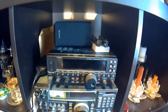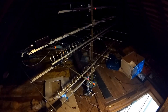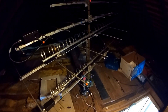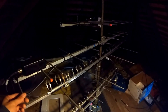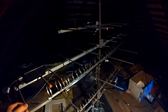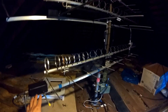Very quiet. That's my HF setup. Now we're in the attic. This is my main VHF/UHF antenna setup. This one is the 2-meter DK7ZB design antenna — 5 element. And on top of that is one of the 432 antennas I built. It's a 10-element design. I designed this 432 antenna, and there's another one down here.